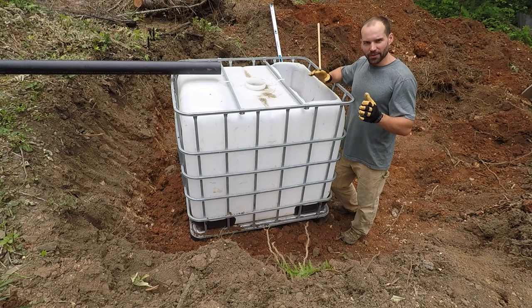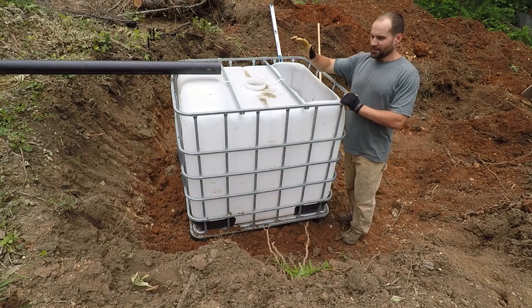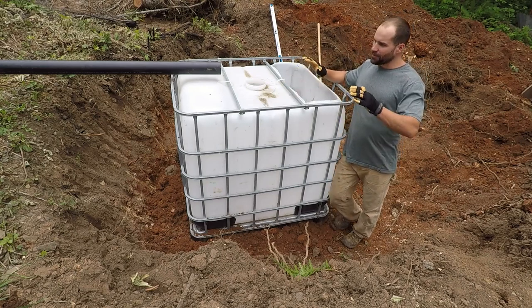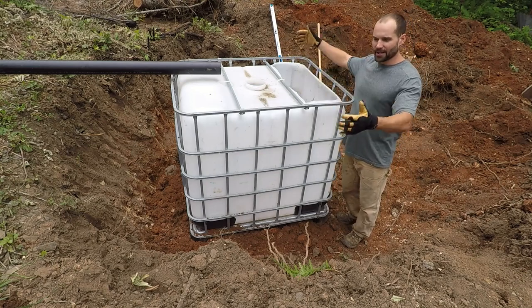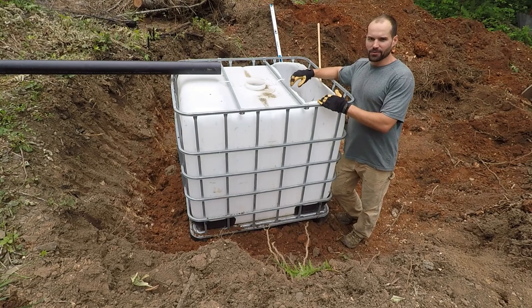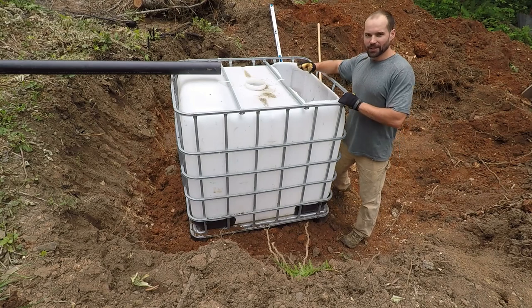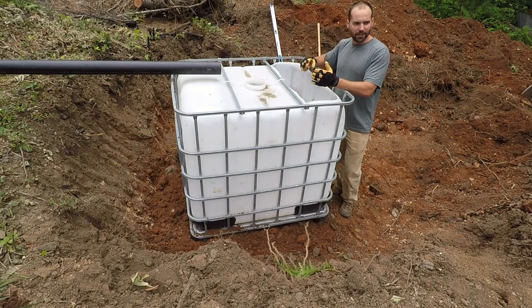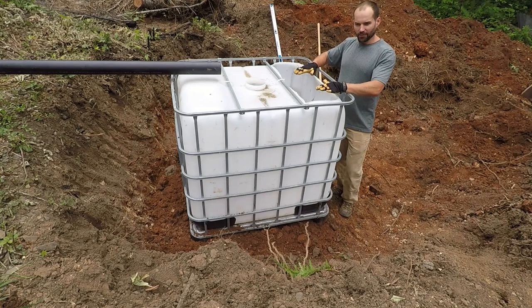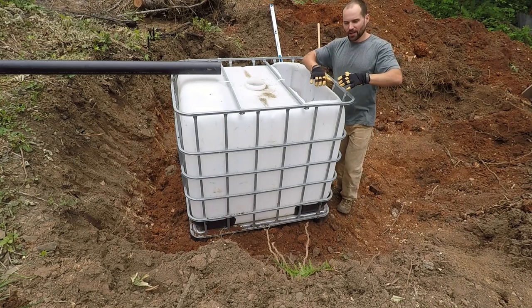In the winter, when it's cold, they just slow down, kind of a cold-blooded creature thing where they're not very active, but they're alive. So even in the short term, I'll do something like some kind of cover, some plywood or some scrap roofing and a tarp or something like that to keep some of the sun off of it. But I'm calling it good for the placement. So next steps, gravel going in and that standpipe that I made going in, and then on top of the gravel, more of that mesh material to stop solids from making their way to the gravel layer.